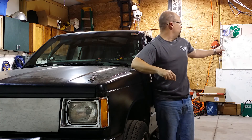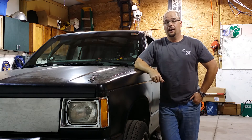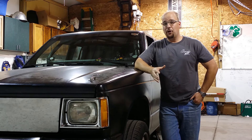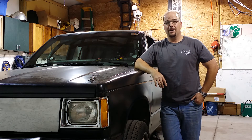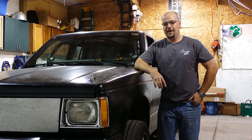I'm going to be going to four banks. I've got a third one sitting on the bench ready to go and a fourth one ready to assemble. With that I will have 1.2 megawatts of power available. I won't be able to use all of that from the Shiba — even though that's the Shiba rating — because I'm at 340–350 volts and the Shiba is rated to 425, but I'll still theoretically be able to send 3000 amps at full voltage minus the sag, assuming I can get the motors to hold up.